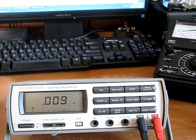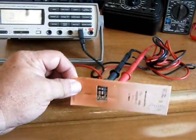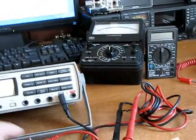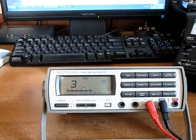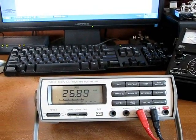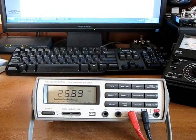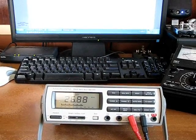Alright, do a quick resistance check and I think we're pretty much done with this machine. I didn't even take the resistor out of the pack — just used the alligator clips to connect up to one of the resistors. It's a 27k ohm resistor, and it reads 26.89k — well within tolerance. I won't show any voltage readings, but that's pretty typical of these things. I have checked it and it seems fine. I hope you enjoyed my new purchase, and we'll try to get some more test equipment out to show. Thank you for watching.